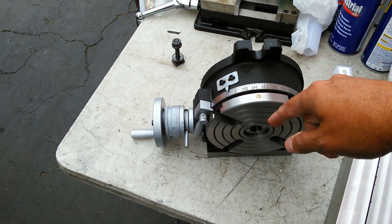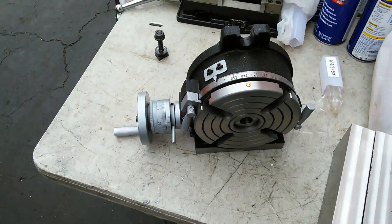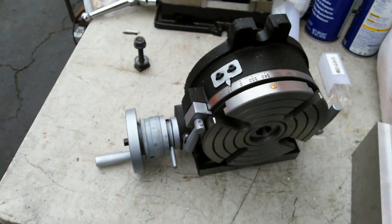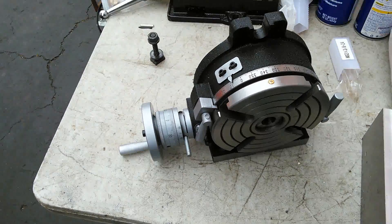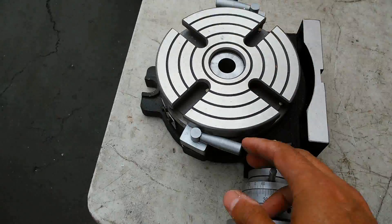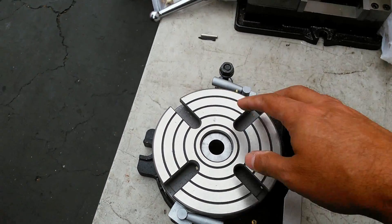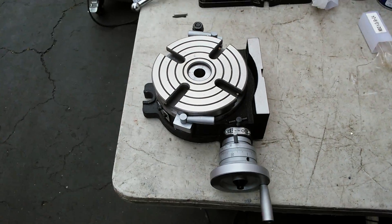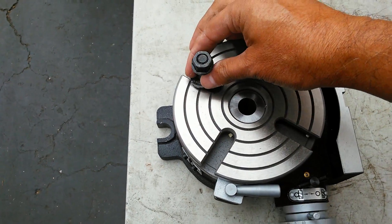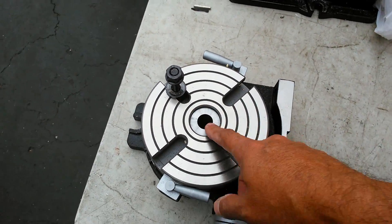You can do drilling or milling operations as the table turns on pieces, so you can get very precise measurements. You've got the degree marks on the edge here, and there's a lot of stuff that's adjustable. You can lock the table in position with these locking knobs - one on either side - very handy.